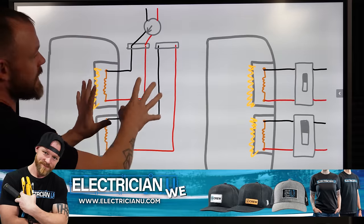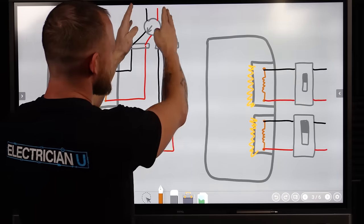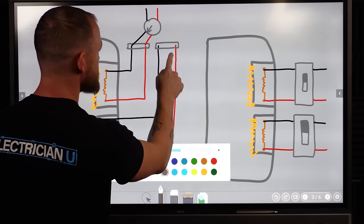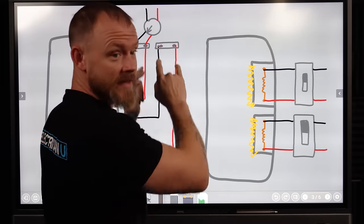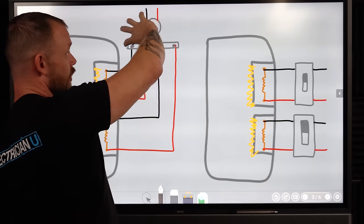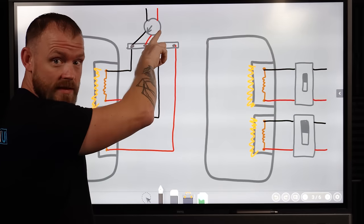Next, the idea of the dual element versus the one coming out of a breaker. One way that I like to think of it is when I notice a piece of equipment, whether furnace or anything, if I see a terminal block, like there's a bunch of screws, screw there, screw there, screw there, and you're seeing multiple sets of wires come in and landing on terminal blocks, that tells me, oh, this is controlled. Some other piece of equipment within this thing has to tell it to switch which sets of leads it's going on.